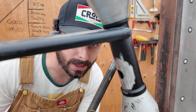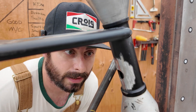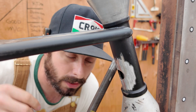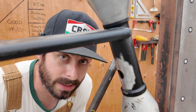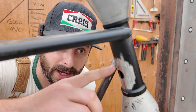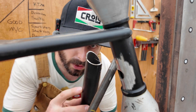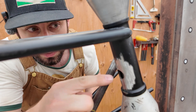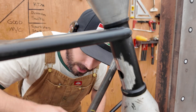I'm ready to start putting these things in except there's a hole in this neck. The original down tube was here and it covered this hole. They're commonly there and the right thing to do is to fill it. Find a piece of metal that matches this one and a half inches — this is 1.5 inches and this is 1.5 inches. The thickness of this much more closely resembles this, so it'll be easier to weld and to finish.